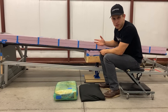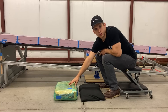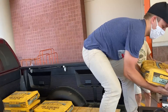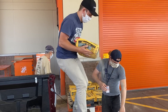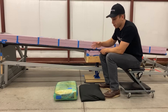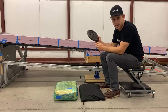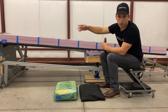For the bags themselves, we used two main types. These sandbags which we've had in the shop for a while, and then these concrete bags which we bought from Home Depot. The concrete bags are wrapped in pallet wrap because they're pretty leaky and we didn't want to get the shop dirty or drop any concrete dust on the wing. That saran wrap also doubled as a sticky surface and prevented sliding or shifting of the bags. We also used smaller plates to make sure that our spanwise load distribution was uniform and smooth as you move from root to tip.